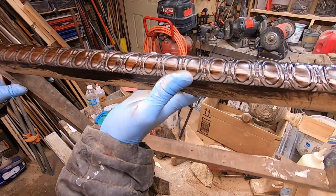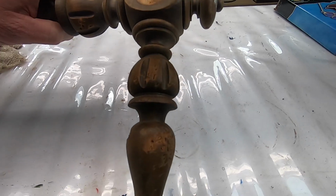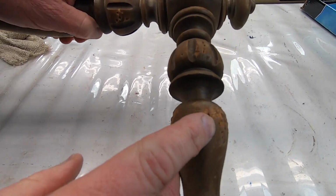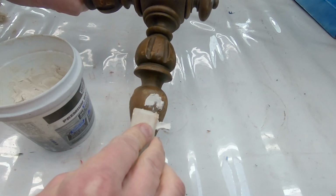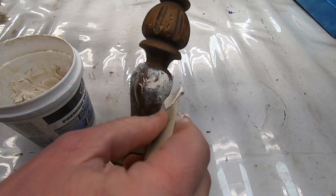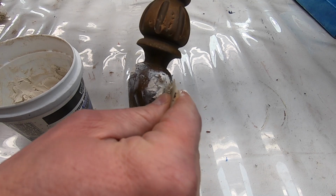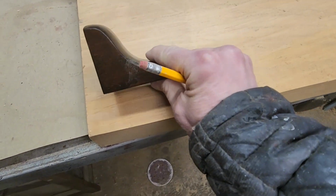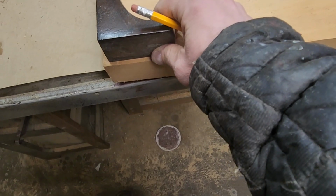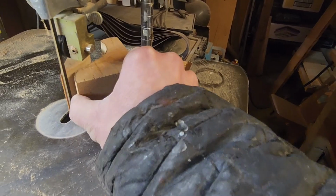This is the spot that looks like an animal took it for a bone. I'm hoping that this damp wood putty is going to fill in and accept the stain as well. Hopefully this damage is going to be unnoticeable when I'm finished. This part here I need to replicate since it was completely missing. I'm using this thick piece of basswood which I bought at a flea market last year. It has a similar wood grain and texture.